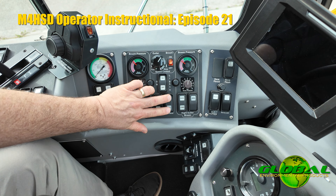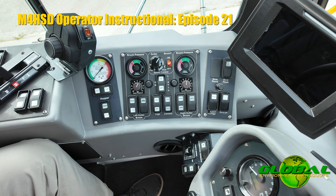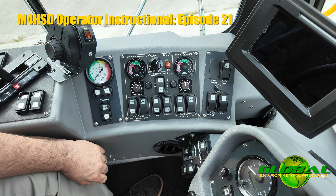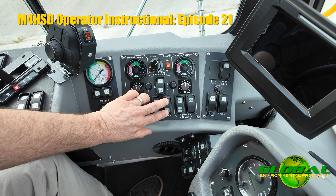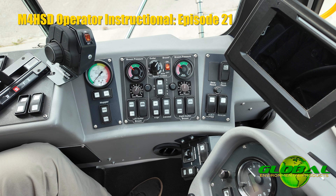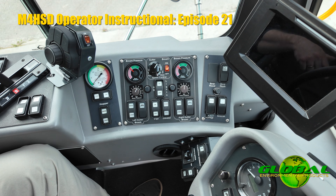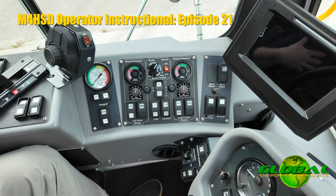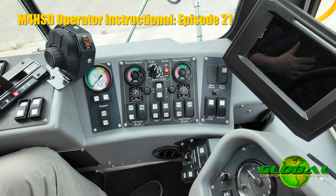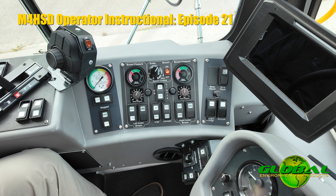As mentioned earlier, the elevator system is also equipped with the ability to run in reverse. If anything gets jammed in that elevator system, you can hit reverse and kick that material out. The same applies for cleaning it at the end of the day — turn that elevator on in reverse, and as you flush out the elevator system, it allows material to drop to the ground as opposed to going up into your hopper, or if the hopper is raised, getting sprayed all over your engine compartment.